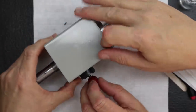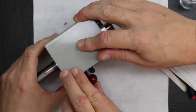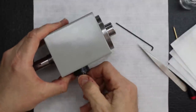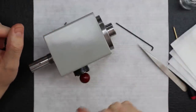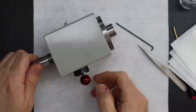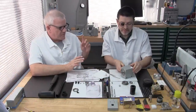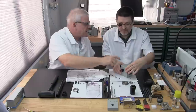Because you use this a lot. Oh, yeah. That's a lot tighter. It's going to wear in a little bit. A little adjustment, just a quarter turn, is going to make a difference. Don't go cuckoo. You can play with it, but it's definitely adjustable. Maybe it's a little too much for you or not enough, but remember, the main goal is to keep it from harmonically moving in and locking itself in a slot while that spindle's spinning.